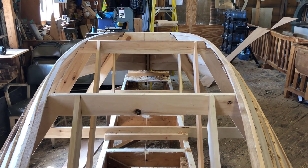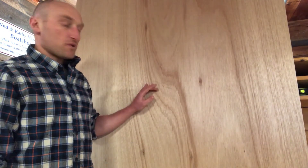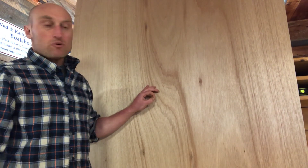It's a single sheet of marine plywood — we use marine plywood for our bottoms. It's three-eighths of an inch thick, which is plenty thick enough. The nice thing about marine plywood is that it's made with what they call African mahogany, so it's naturally rot resistant. It's a tropical hardwood.